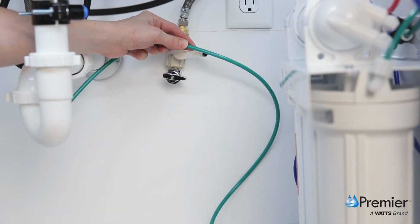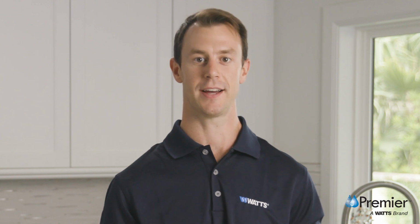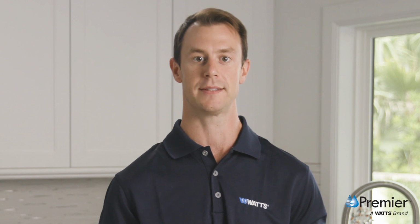If the tubing is excessively long, you can trim with a tubing cutter, taking care to make a straight cut. Before cutting any tubing shorter, determine your desired mounting location and make sure that you have enough tubing length to dismount the system to perform any required maintenance.